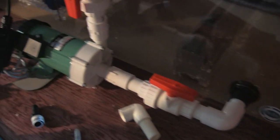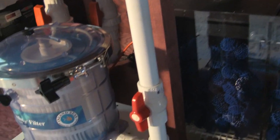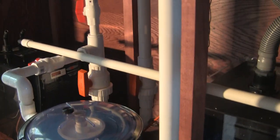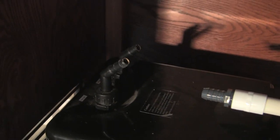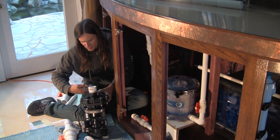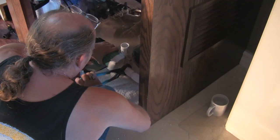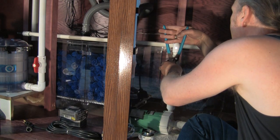As we secure the canopy to the wall behind the tank and confirm that the mock-up we've done to the plumbing system is what we want, it's now time to begin to glue and thread the various fittings. Not including the soft tubing, the hard pipe portion of the job is now ready to go to the next step — gluing with PVC cement and threading with Teflon tape, followed by the careful tightening of the threaded fittings, adapters, and inserts.